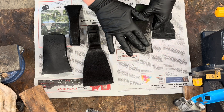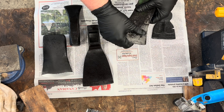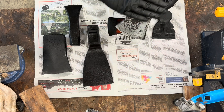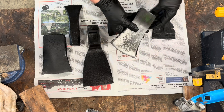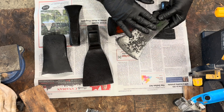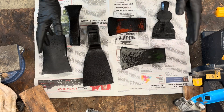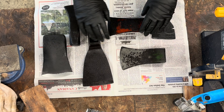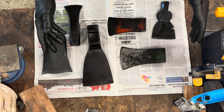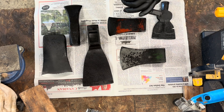When you have bare steel and boil it in the tannin solution, you get a black coating, but that wipes off, leaving a gray patina similar to what you get from vinegar. In that case, I just buffed it up a little with fine-grit sandpaper to brighten it. I think it looks better now with the black patina instead of the brown and red rust it had before. I'm not going to use this technique for every project, but I'm glad to have it in my repertoire. If you have any questions, let me know in the comments — good luck and have fun with your axes.